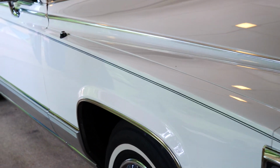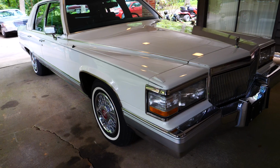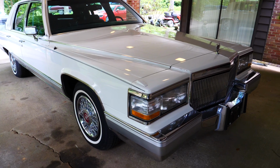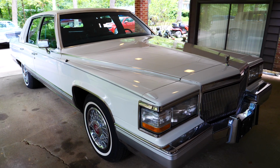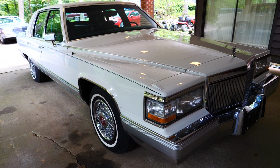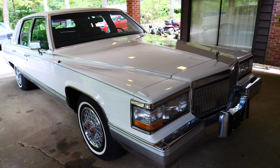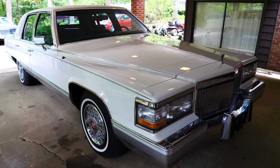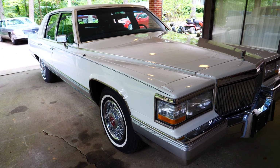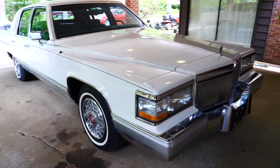I saw a production video, maybe you've seen it on YouTube. It shows the Cadillac factory back in the 80s, right before they closed down the plant at Clark Street. It actually showed how they did the pinstripes, which I always kind of wondered, because they are painted on. And you figure in an assembly line setting, it must be a really efficient way of doing it, and it is. A giant ladder-like frame comes down with pads on it, and it would lean up against the side of the car, offering sort of a guide, and a worker would come along with a paint roller and roll the first stripe on.